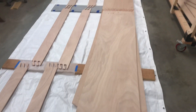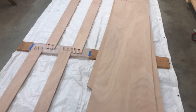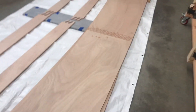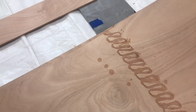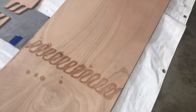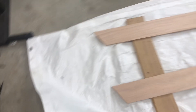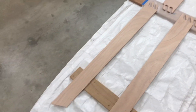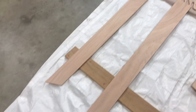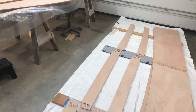Here are the sides of the boat, which are two pieces. I laminated both sides together yesterday using these puzzle joints, which are really amazing — they fit so snug that everything is aligned up perfectly. Over here are these three-part wale strakes which I'm getting ready to laminate together. These are half inch — or three-eighths, I can't remember — but they go along the shear line of the boat to reinforce it once I get it set up.